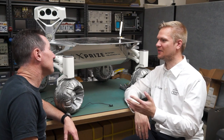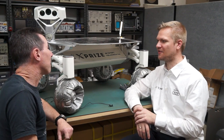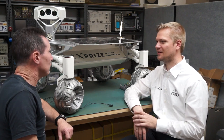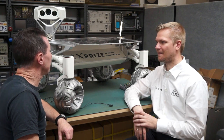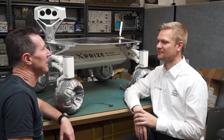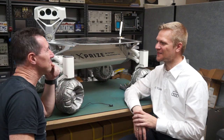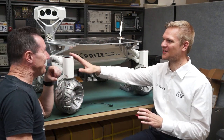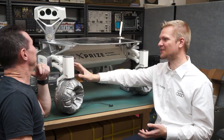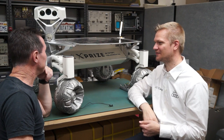So we're running at a pulse width modulation frequency of about 64 kilohertz with the motors. Is that synchronous to anything else so you don't get radio interference? No, you just don't care because the motor controllers are out here. This is one of the significant advantages of having them outside, physically separate. This is aluminum, so it's really well shielded, and this makes it much easier.